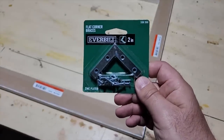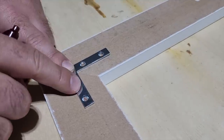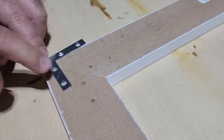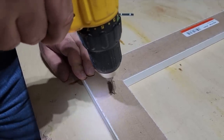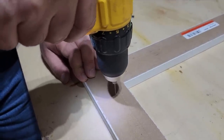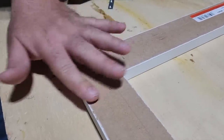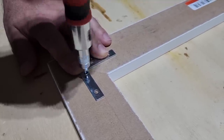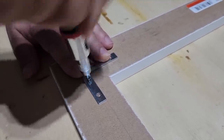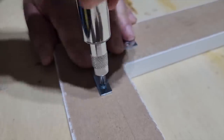You've got to get some flat corner braces — that's what's going to hold these frames together. Just mark out the holes, but you've got to be careful: we need to pre-drill all the holes. That way the screws hold inside this MDF wood as easily as possible. Once you pre-drill, the screws go in without a drill — you can just use a regular screwdriver. Make sure you get it nice and tight, but don't over-tighten. We just want to make sure it's snug and holding in place.